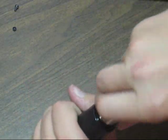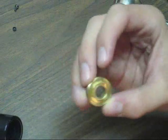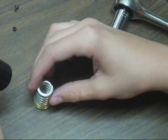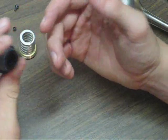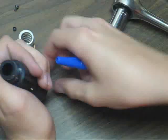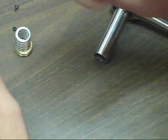You can see it coming up there — and that's the end cap of your regulator assembly. Then a spring will fall out. The important thing is the piston that's left inside there. What you have to do is get something like a pen, a dowel, or a piece of tubing — something non-metal — to push the piston out so you're not damaging or scratching it. It shouldn't be too difficult, just put a little bit of pressure on it. And there's your piston, pretty much the working part of your regulator, and that is what you actually have to lube.